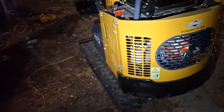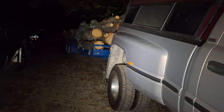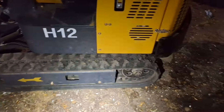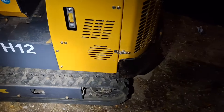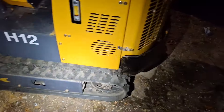The Mini's back home. When I grabbed my trailer, I brought the Mini home and then went and got that wood. I've got to spin this thing around and tilt it up — the adjuster came loose on this side and I haven't checked the other side yet. If I've got to adjust the tracks, I'm going to do them both at the same time and then lock the adjuster nut down.